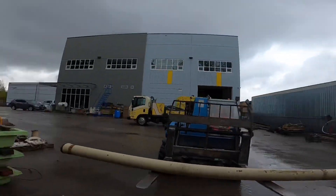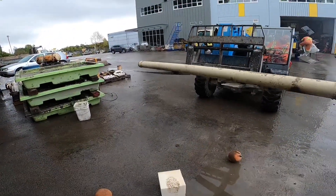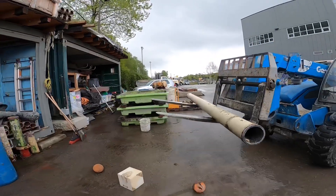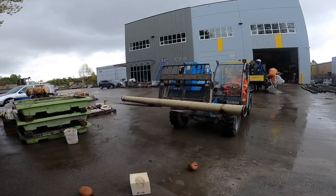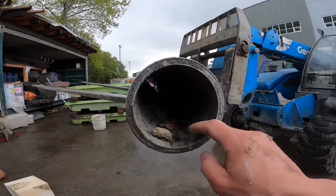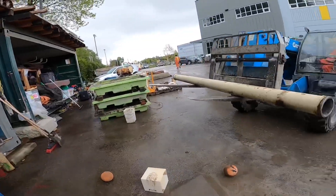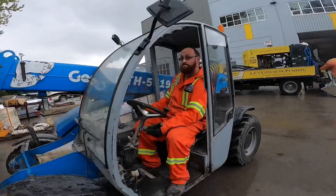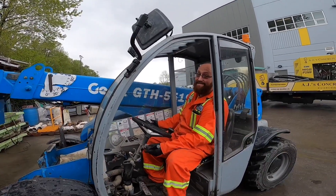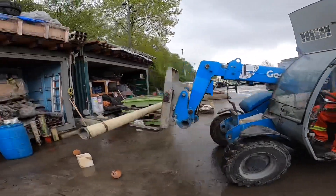Lesson to be learned: when you're doing a lot of slow pours like we do with that little 24 meter pump, use a hard ball, use a go devil - whatever. Doing just one or two soft sponges isn't always the right call. Neither is water washing or sucking a bucket every time. I do use all of these methods from time to time depending on the job, but you've got to use your discretion as to what is most appropriate on any given day. We'll get this all banged out, get the pipe back on, and moving forward we will make sure it's cleaned out properly with the appropriate sponge and appropriate technique. What's the lesson of the day? Don't suck off sponge balls - go hard or go home. The jury has spoken.